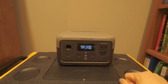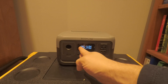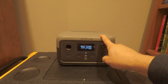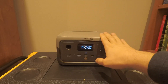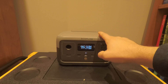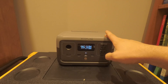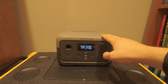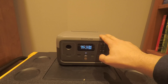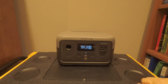The app lets you set charge limits — for example, turn off at 20% so it doesn't discharge below 20%, and don't charge over 80%. Keeping the battery in that sweet spot between 20% and 80% significantly extends life expectancy, potentially getting you five or six thousand cycles — well over 20 years. They also give you a leading five-year warranty on this power station, which I think is unbeatable compared to the competition.